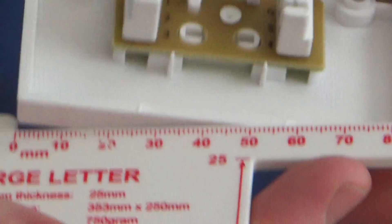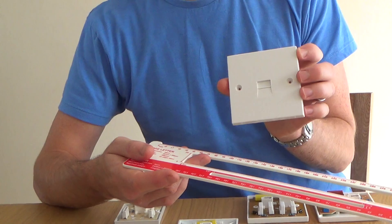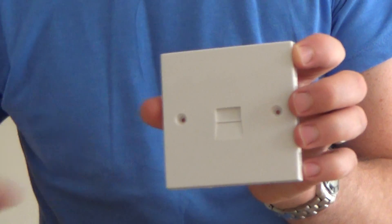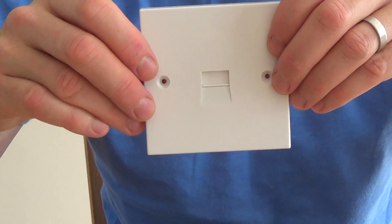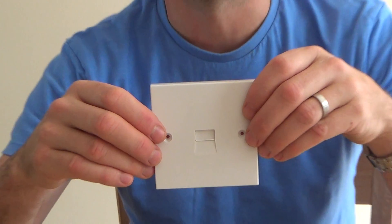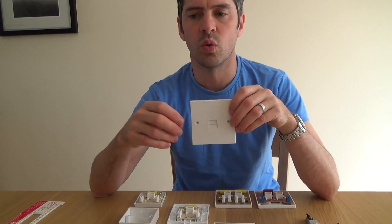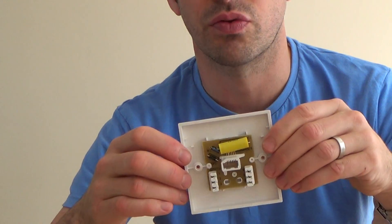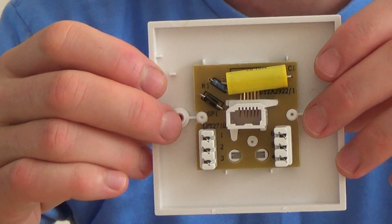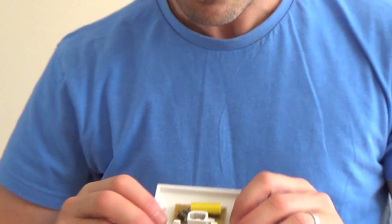All of the three series sockets are approximately 85mm by 85mm. They don't come with any back boxes because they're designed to be flush mounted. So if you have an electrical back box already sunk into the wall — for example during renovation works or on a new build property — the wires are hidden and you use a flush socket like this. The three series will fit a standard UK electrical back box.